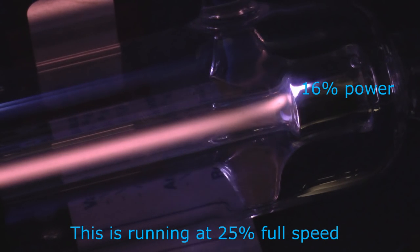Whether it's something to do with a resonant frequency within the power supply, or whether it's something to do with the mix of the gas or the anode and cathode, it could be any one of many things that influences this frequency and the range over which it occurs. So now we've established that we've got an unstable high frequency at the low power end of the range. What happens when we drive into the so-called stable part of the operating curve?